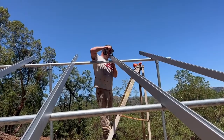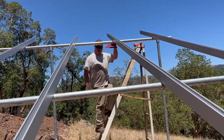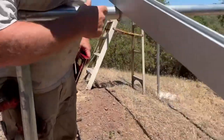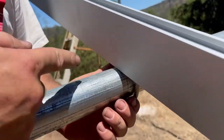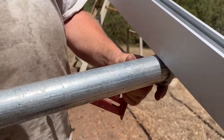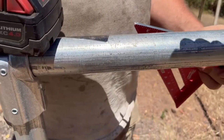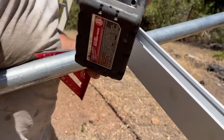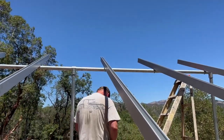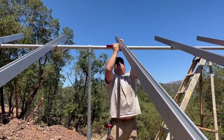We're almost done. Right now we're making sure our rails are square. I measured all the distances down below, and then William takes the square. My mark's a little bit in so it's got to go that way — there we go, that's pretty good. Up at the top he takes the speed square, and as long as they're square, we know we're good. We don't really have to measure so much.